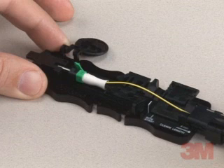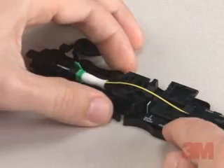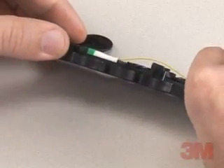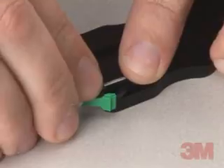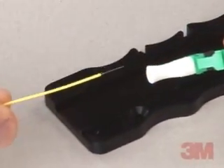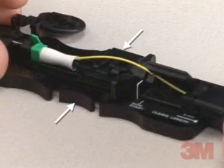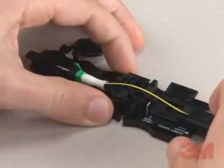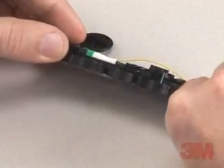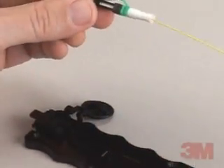The funnel will stop on the fiber holder when the ears contact the release lever. Close the actuator button on the assembly tool base and firmly press to actuate the splice. An audible click may be heard when properly actuated. It is optional to remove the LC connector and test it at this time. If the connector performance does not meet expectations, the splice cap can be popped, fiber removed, and the fiber re-stripped, cleaned, and cleaved again for another try. Squeeze the release lever on the side of the tool base and push the ears of the fiber holder forward to actuate the buffer clamp. Lift the remaining fiber covers and clamp on the fiber holder to release the fiber. Slide the fiber holder from the assembly tool base. Pull the connector from the coupling to complete the termination process.